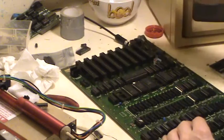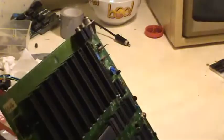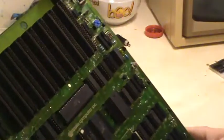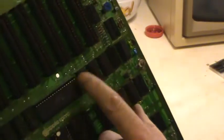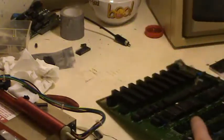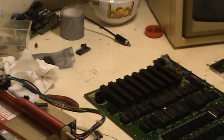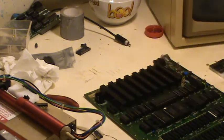This is the second board I got. It's 46th week of 1980. It's different than the one I had because, up here, there's no DBA304 chip, just these ones instead. Anyhow, this didn't work either, and I found the bloody 5 volt to ground short on the power switch, but I actually managed to fix that.